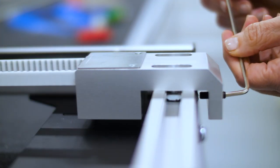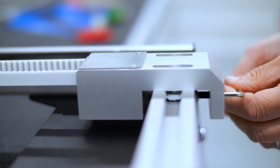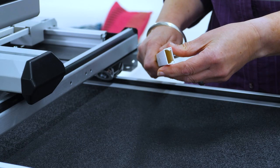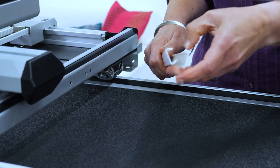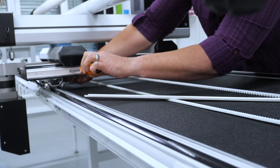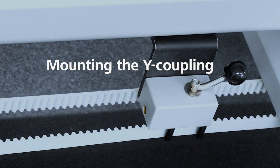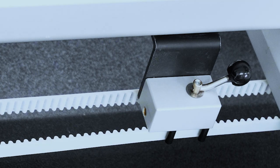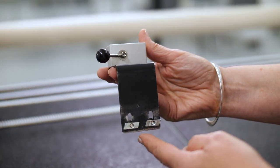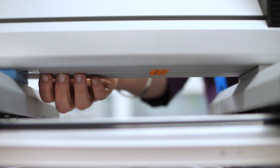To pre-tension the wide drive belt, loosen the screws slightly and pull the idler plate backwards until the belt is taut. Additionally, mount the cable duct to the right side of the carriage — remove the cover of the cable duct and set it aside, then screw the cable duct to the carriage. Next, mount the Y coupling in the groove underneath the machine. It is very important that you align the nuts perfectly horizontally on the coupling. Feel the groove below the machine where to insert the nuts and where the wire coupling will be attached. Please refer to the manual for a better view.